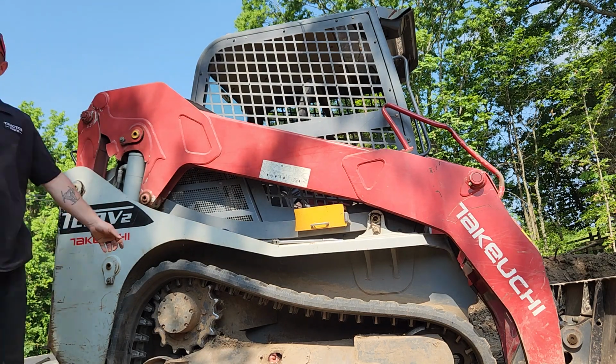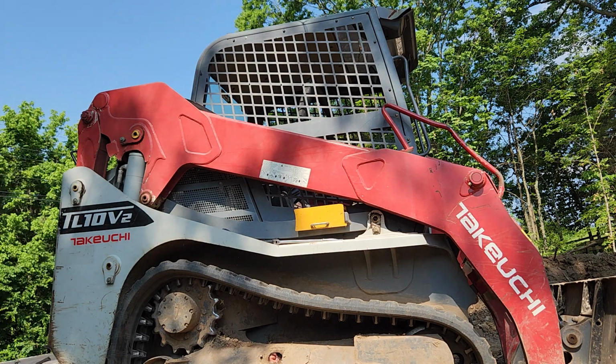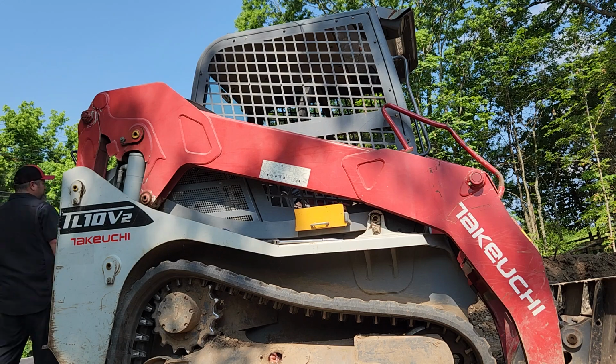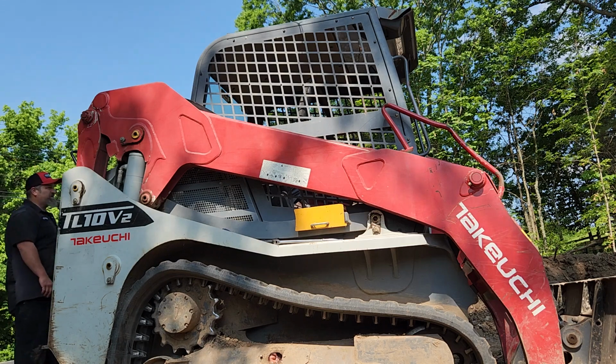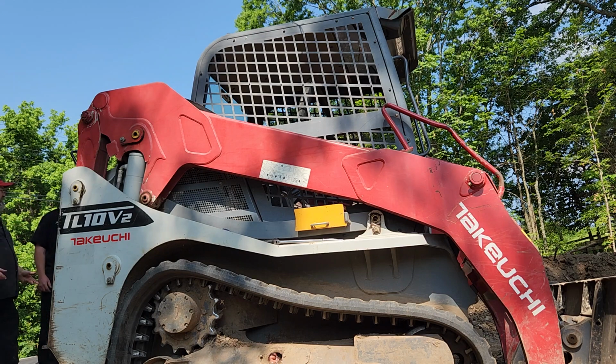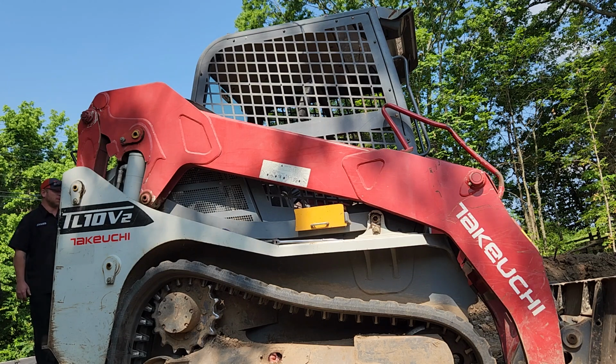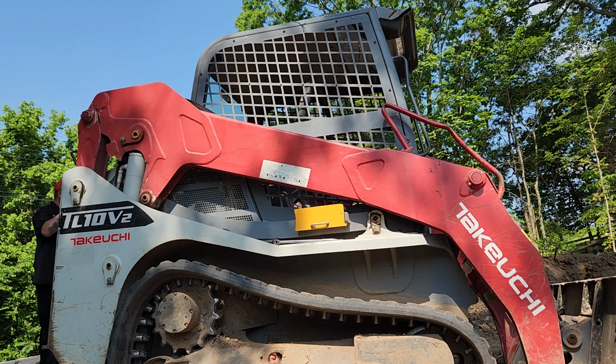Okay. Same principle. I have a question for you also, I want you guys to fix that, because in the last 15 minutes I was hearing some creaking over here on the side. That's probably just some settling, hydraulic settling. Don't pay any attention. Whenever we get them, we always test them to make sure the cylinders aren't leaking internally, so we put them up and do a drift test, which is exactly what it sounds like. You measure the drift over a certain period of time for internal leakage. We check them. Yeah, this has a little bit, because I lifted something, held it up, and within about an hour it dropped a few inches. That's usually normal, perfectly normal. That's usually acceptable, because you're allowed some bleed past of the internal leakage.